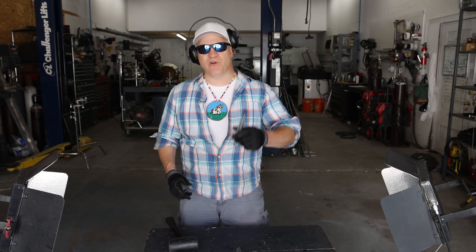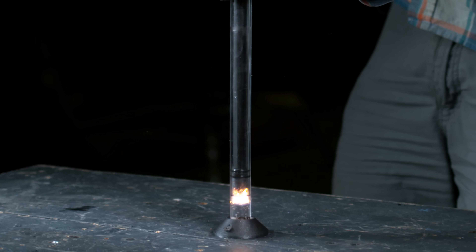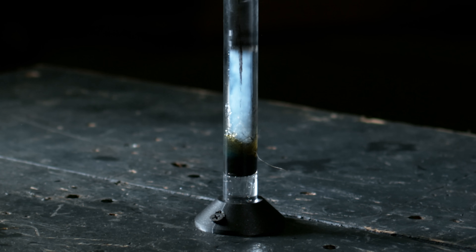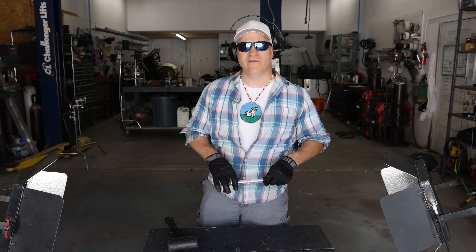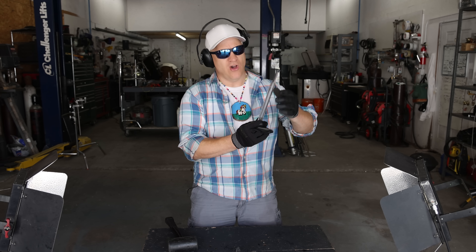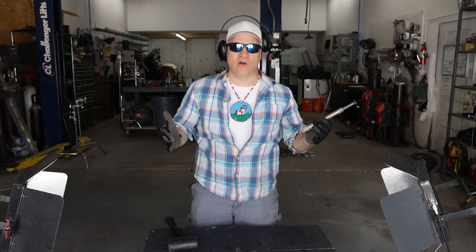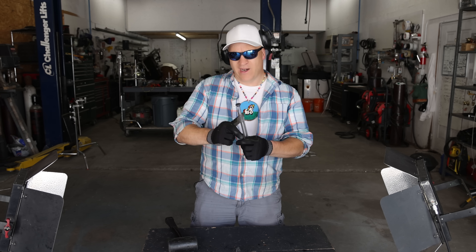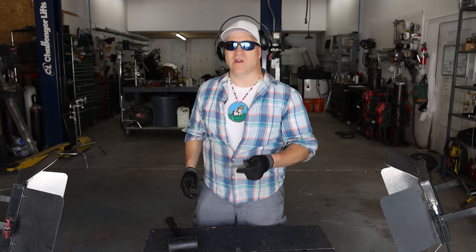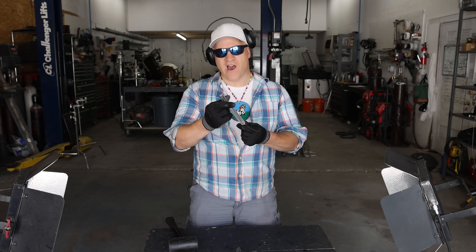I had the same result as the previous attempt. That was pretty interesting to me — I got an entire tube full of fire just from a piece of cotton cloth, but with the diesel it's just blowing up the tube. The only thing I can think of is that the diesel has so much more energy potential than the char cloth, so when it ignites the piston is still traveling in and the pressure has nowhere to go — it's just blowing up the tube. I did find it very interesting that you can create enough heat and energy to start a fire or create ignition just from compressing air.